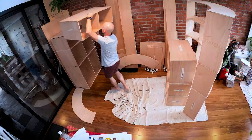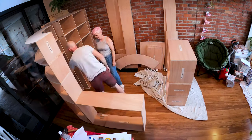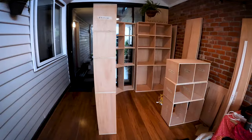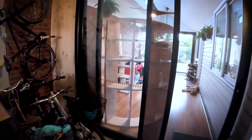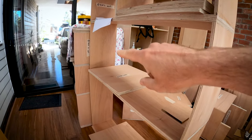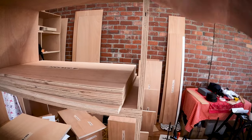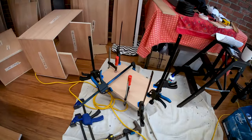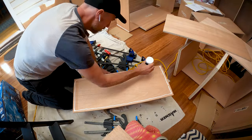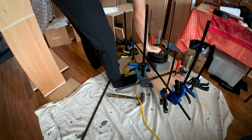With three and a half of the shelves built I wanted to line them up to test how they were going to come together and to see if we'd got the cutting list right — which we hadn't. The vertical pieces on the bottom box of the curved shelf was actually short by about 25mm or an inch. Annoying but thankfully not critical. Note to self for next time: double check all cuts prior to assembly. Still it was great to see the Megapod coming to life. As you can see here the boxes will stack together creating a 24mm — just under an inch — shelf. At this end I'll need to add an extra strip that runs all the way down and in the middle of each shelf I'll have a divider creating two boxes out of each shelf. For the middle pieces I actually need to glue two together. I ended up using an absurd amount of clamps because they often wanted to slide apart like opposing magnets, and I didn't want to use nails here because unlike the boxes where the nails would be hidden, there was nowhere to hide them.